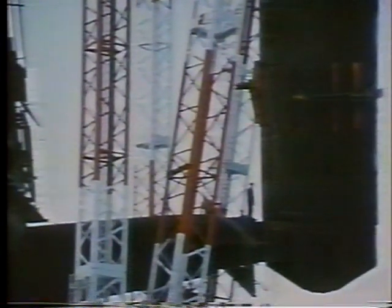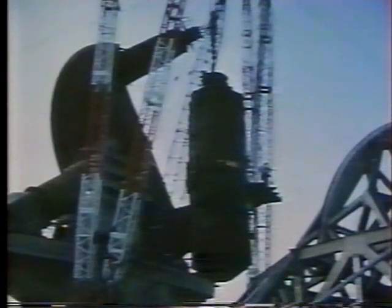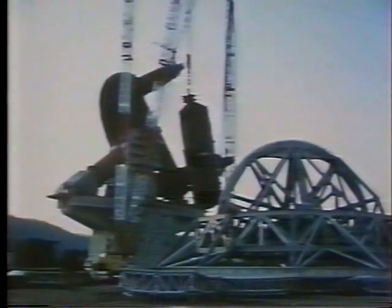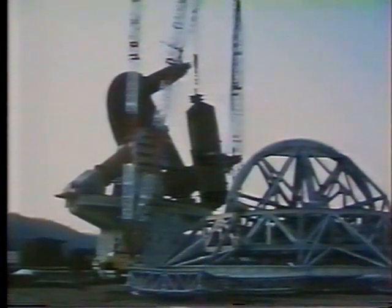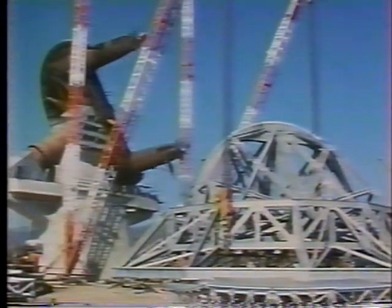The superstructure could not be used for these tests because it will not swing past the 2 derricks, which could not be otherwise located, and lift the superstructure to its final position. Every erection step has been planned around these 2 derricks in their location, dictated by the superstructure lift. The aluminum superstructure is now completely welded and has been moved within reach of the 2 hoists. Steel pick points have been built into it for its lift.